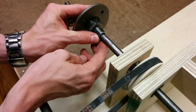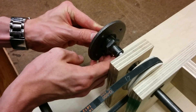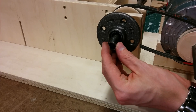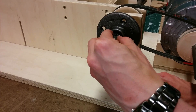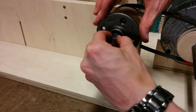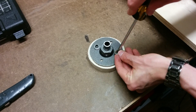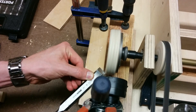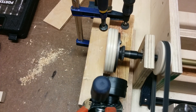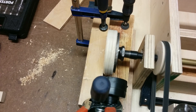To attach the sanding disc to the shaft, I had this idea to make a hub out of black pipe, a flange, and a pipe adapter. This looked like it was going to work — I cut all the pieces and it fit on the shaft quite well. But I overlooked the fact that the motor rotation was actually going to unthread the parts I had threaded together, so it just wanted to fall apart.